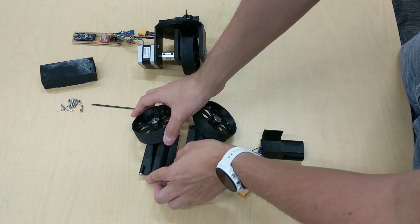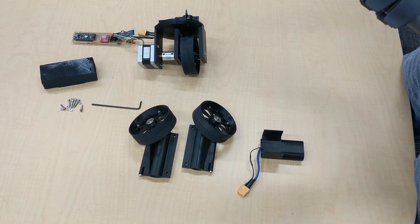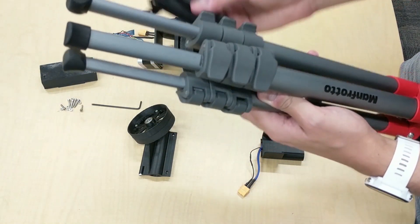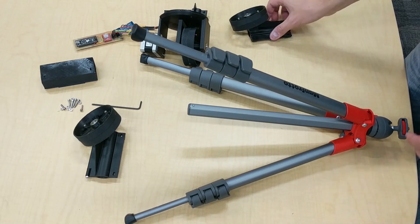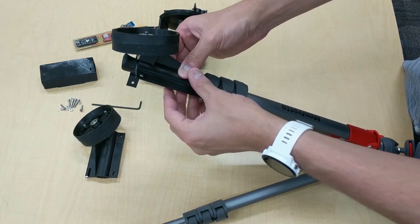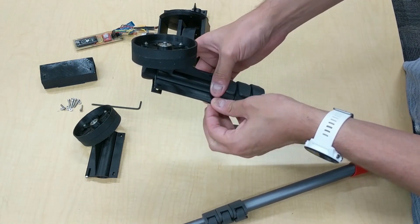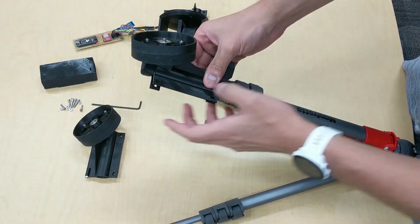Here is the second wheel, and we're going to put the wheels in the tripod legs. Let me extend the tripod legs so you can see. We need to clamp the wheels, so I extended the tripod legs so you can actually fit the wheel. As you can see — let me lay the tripod flat — the clamp nicely embraces and when you bolt it up together it's going to be nice and sturdy. This basically acts as the end stop, so even if the friction doesn't hold it, it could slide but then eventually it's going to stop. That's why I only extended this much.